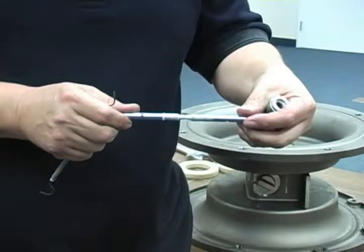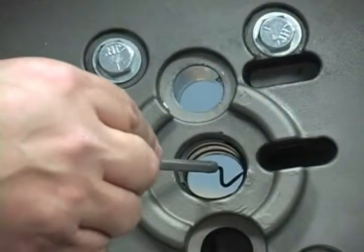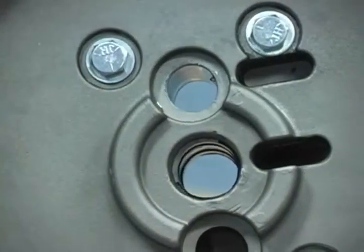The pilot spool cap seals are not available for individual sale and should not be removed. Inspect the main shaft glide rings and replace them if they are worn. Please note, once the glide rings have been removed, they become damaged and may not be reused.